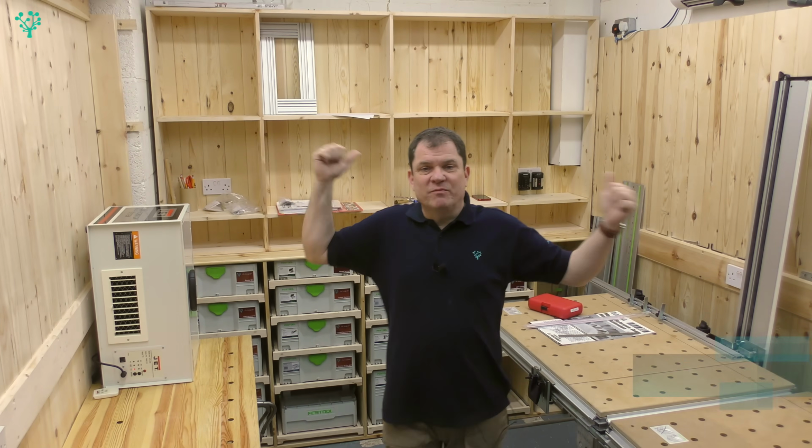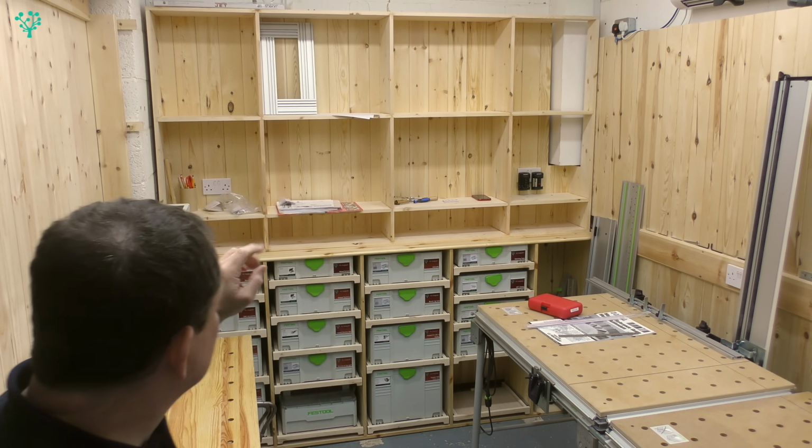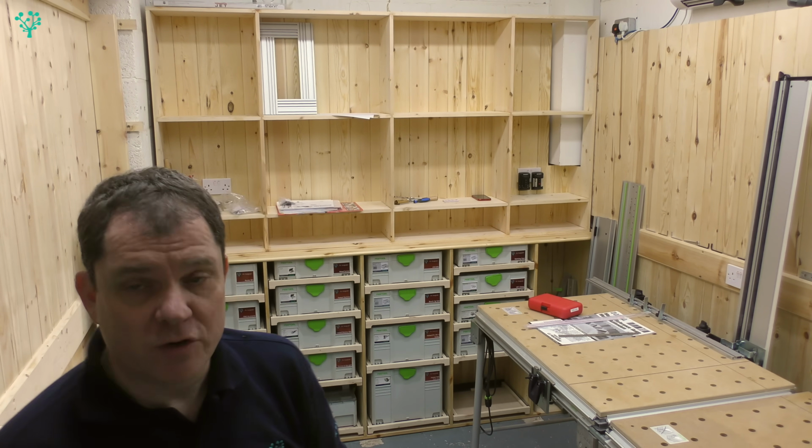As you can see, I've put the bookcase into position, and did I mention in the last episode, that's heavy, really heavy. But you can see we've done it. It's a good fit, it's exactly where we need to be, and now we can start to look at the drawer units. We're going to use the Incra fence system, and all the drawer units are going to be dovetail construction. To be precise, blind dovetail construction.